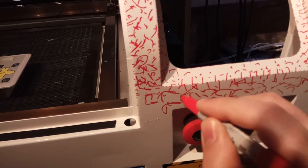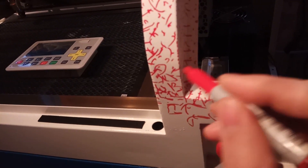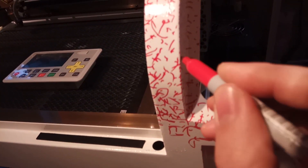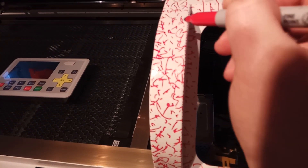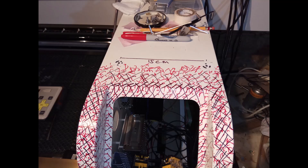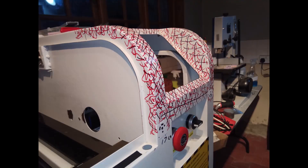The trouble is, this paintwork is rather shiny and reflects light, so this would normally be a really bad surface to capture 3D data off. I had to scribble markings all over the area to create a decent amount of high contrast details that the software can see to build a point cloud. I then placed printouts of special marker points that I could later use to scale my mesh correctly in the 3D software, and then took tons of photos at various different angles, focusing on the area I needed to scan.